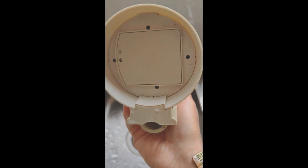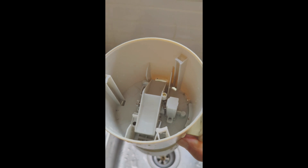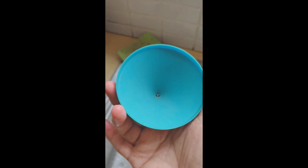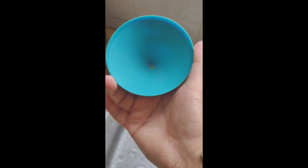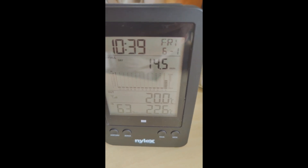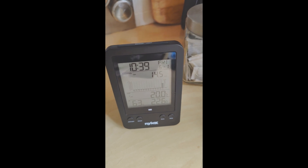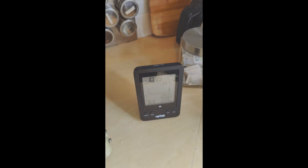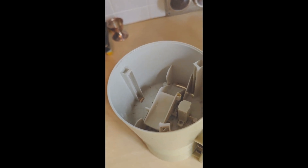I haven't gone further as far as removing the bottom of the unit — I don't think it's necessary, everything else should be quite okay. We also need to check the funnel itself just to make sure it's all free and clear, and give that a clean to remove dust and anything else that can accumulate inside and inhibit the workings of the unit. During the process we've registered a remarkable 14.5mm of rain, obviously due to moving the rocker back and forth. Moving the rocker once — okay, there it is — it does 0.2mm every time the rocker tips across.